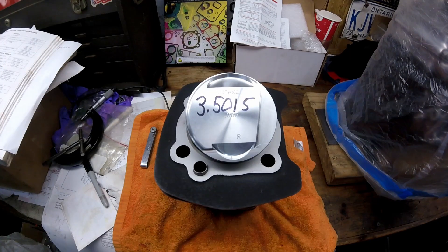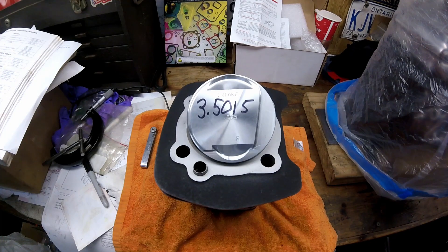This video is about checking piston clearance and ring end gap, both very important when setting up your engine. If you're buying pistons and cylinders from the aftermarket, you should check these. John from John Cycles said many times he's seen where people buy sets from aftermarket manufacturers and the clearances aren't right. These were all done by John and he reassures me they're right, but for the sake of the video I'm going to show you how to check them.